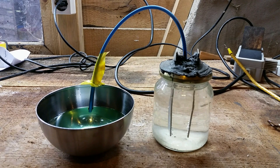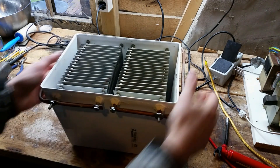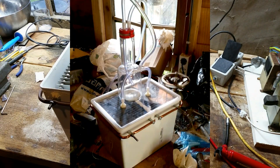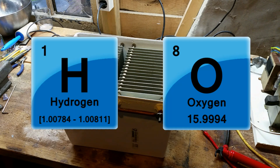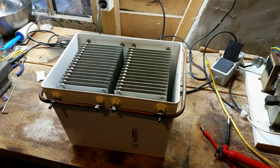I did this experiment to see if standard grade stainless steel is good enough, and it is. So then I made this — a larger version of the jar generator. It also has an anode and a cathode, but with much larger surface area. It produced much more hydrogen and oxygen than the jar version, but it also generated a lot of heat — actually more heat than gas.